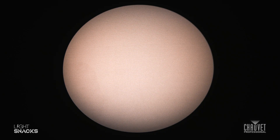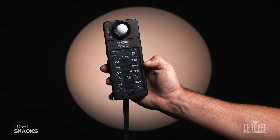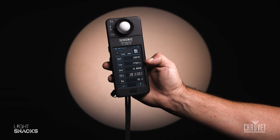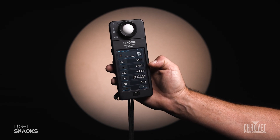Getting down to 4000K using just our CRI filter and CTO filter is pretty straightforward. Our CTO filter is in just over halfway at this point. Taking a look at this measurement, our color temperature is just under 4000K. Our delta UV, we're a little bit off the black body curve — we could probably improve that a little bit. And our CRI value is 85.5.